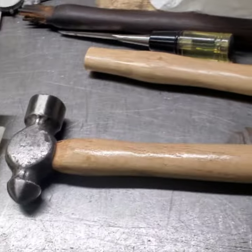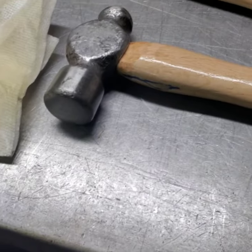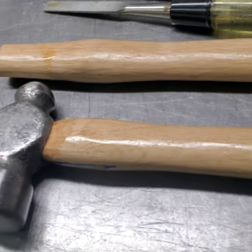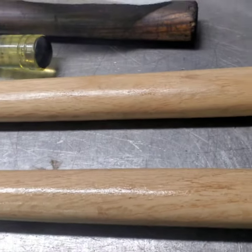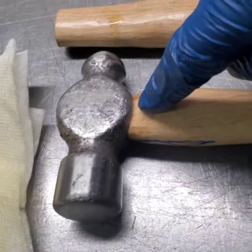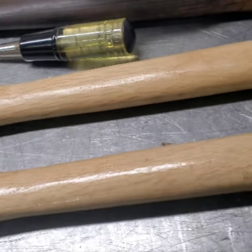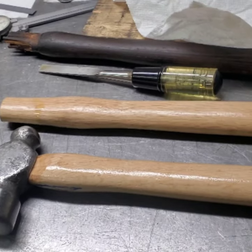I'm back and I've got a couple of applications on there. You can see it's still a little wet - kind of hard to tell the difference but I'll let that soak in. Probably in a day or so I will put some linseed oil up around the head and let that soak into the wood. There was a lot of draft angle in this old hammerhead - I put the big side down - the hole in the middle was quite small. Anyway, the linseed oil will help swell that dry wood out. There you go - we've restored our hammer handle and it came out pretty good.